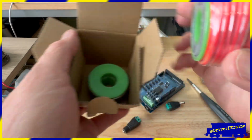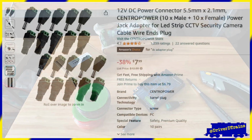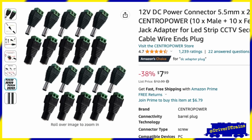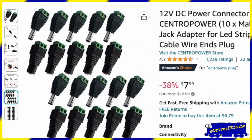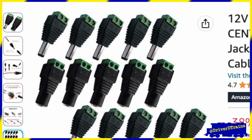We will need 3 pairs of wires to power our DCC-EX command station and connect it to the main track and programming track. To make the connections easier, I recommend using some of these screw terminal barrel connectors, male and female, in the 5.5mm by 2.1mm size.